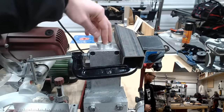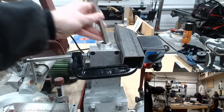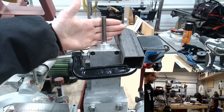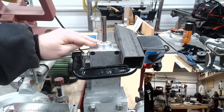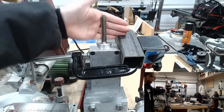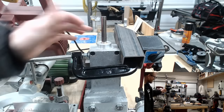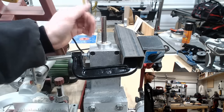I put a rod in here, and I checked the squareness. Right here's the rod. So I put this rod down in there, and then I've got one of those little magnetic angle gauges. So I just put it on here, and I verified that this bore, that I actually turned between centers after I had the bearing installed. So I checked the relative angles of this gauge that I put into the bore with the bed ways, with these vertical ways, to tell how far it was out of alignment.